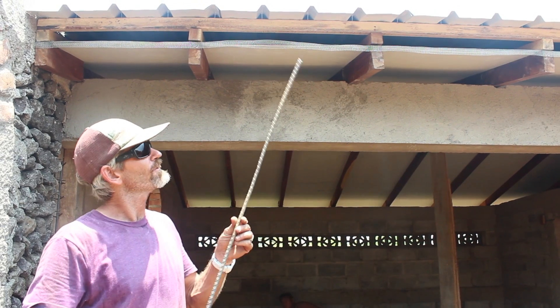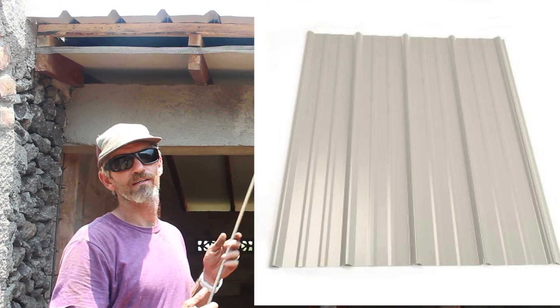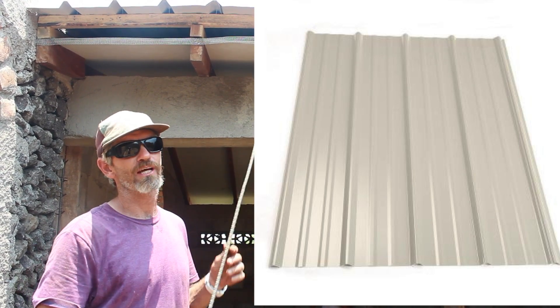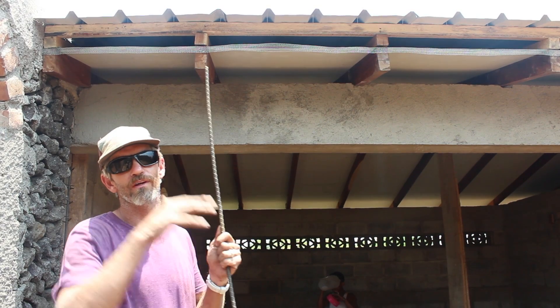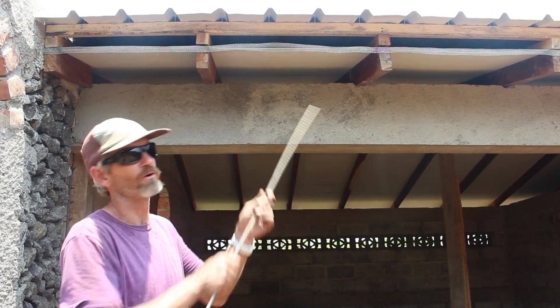This metal roof is structural zinc that's been factory painted — we chose white. White is the color that reflects the most amount of heat. For this type of roof, in theory you don't have to use white; you could use other colors, because the more the roof heats up, the more it sucks air from below up through the top.